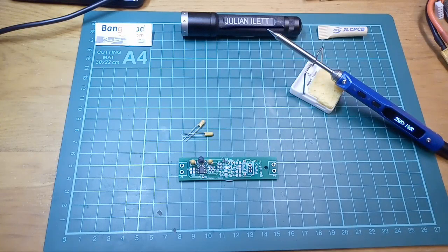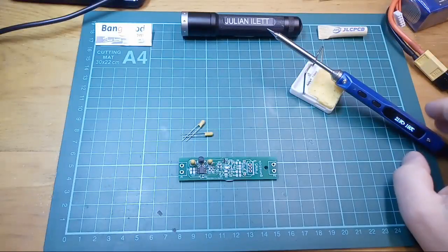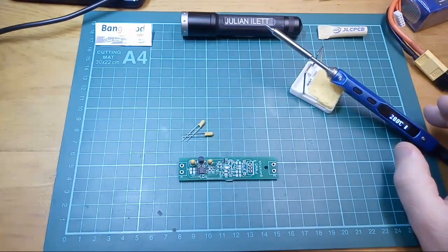Okay, let's have a look. I got the TS100 about 2 weeks ago. I like it, but sometimes I seem to get shocked while using it. Yeah, you're probably using a mains power supply, aren't you? Plug it into a LiPo. You can't get a shock from a LiPo. 65 watts at 24 volts. Yes, that's right. And then it drops. At 12 volts, I think they say 17 watts. Well, now my Antex iron is 18 watts. And I'm very familiar with that sort of level of power.